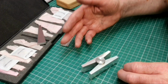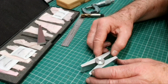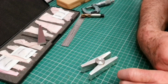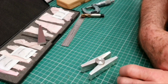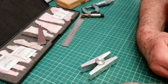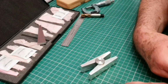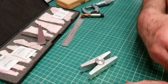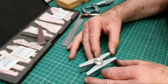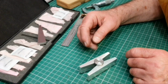Off camera, before I started machining the other 3 angles, I took the handles off, and what it was is the bearings at each end of the lead screw on the x-axis, I think, were very dry. So I pulled them out and gave them a bit of a clean up, and then re-lubricated them and put them all back together again, and it seems now to have cured the problem. So hopefully I won't have that terrible noise on the milling machine in the future.